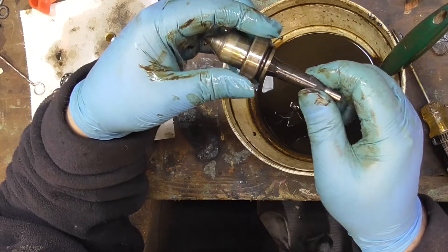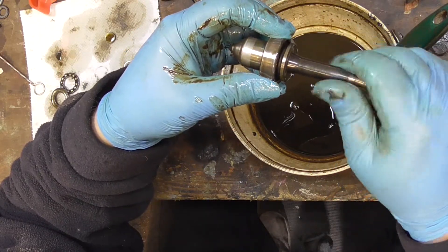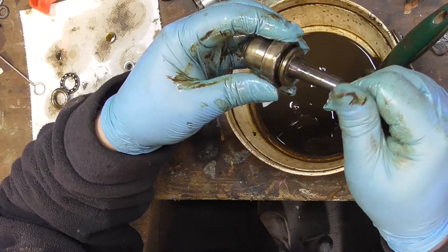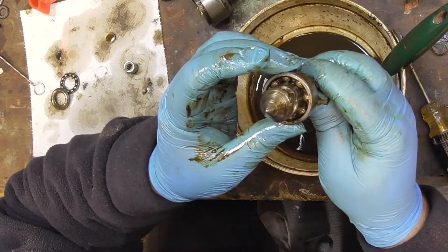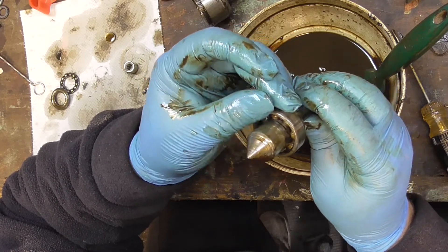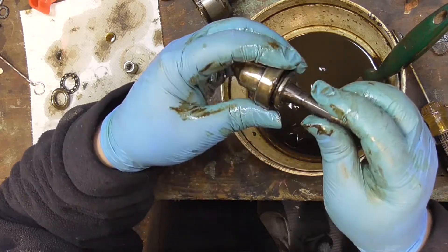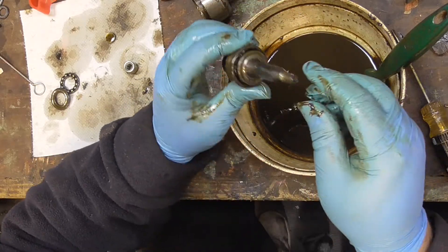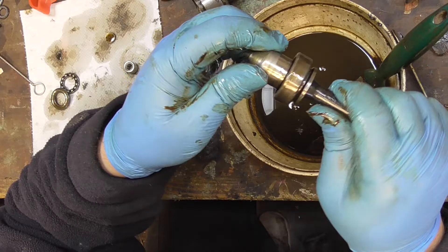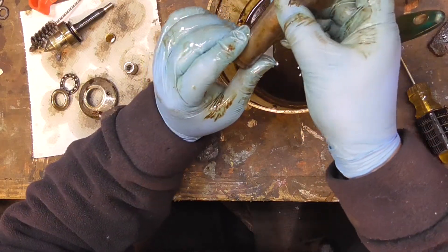The thrust bearing - if I was going to replace the thrust bearing, I might replace that roller bearing as well. It's running free enough and it's not graunchy, but I know that's effectively dry - there's no oil or lubricant. It's whether these would come off easy enough. M-A-N-Y... Germany. German bearing. GMN. And it's 6202, right. So that should be easily replaceable. I think this one's rebearable, subject to the cost of the bearings and whether it's worthwhile. I'll just get these rinsed off with a bit of white spirit and I'll bring you back in a minute.